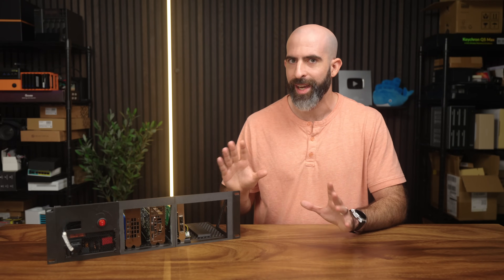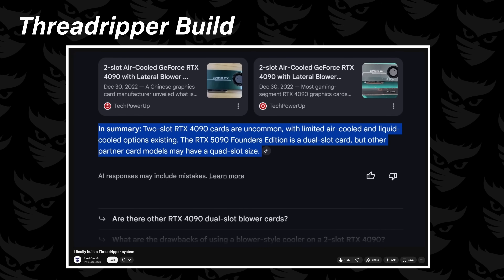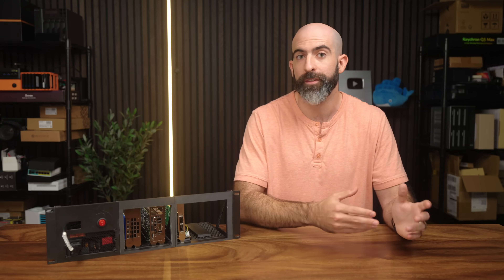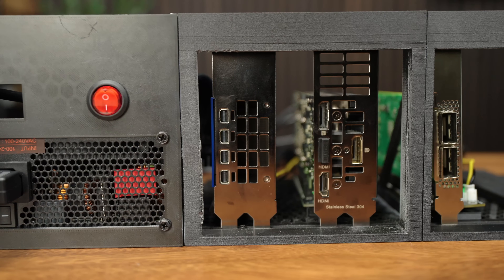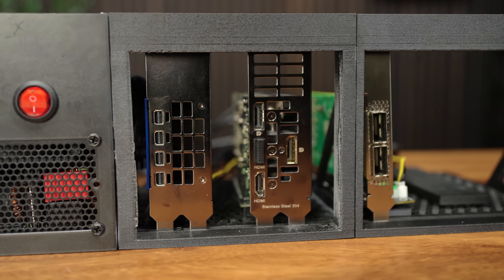This isn't limited to high-end servers with over 100 PCIe lanes. In my latest workstation build, I specifically had to go with the only dual-slot 5090 that exists, since any other one would block off the other PCIe slot I needed for my network card. So yes, the use cases are niche, but they are legitimate. The other situation you may run into is that your PCIe cards may not physically fit into your chassis at all — this is super common for 1U and 2U systems where you're often limited to single-slot and half-height cards. If you have a 2U system with tons of PCIe slots but want to use big beefy GPUs, you're out of luck. With this setup, you can add plenty of space for PCIe expansion and only take up 3U of rack space.